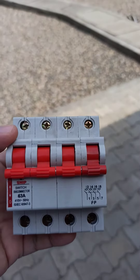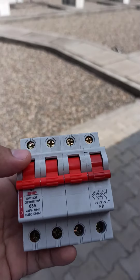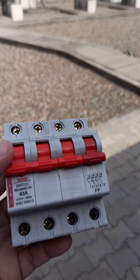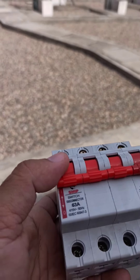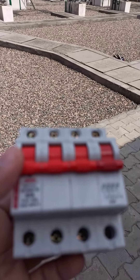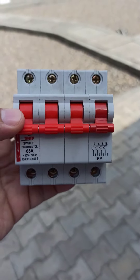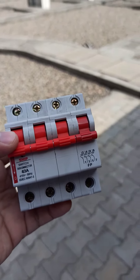Whenever we need to do maintenance, we can operate this, but before that we need to operate the circuit breaker first. This is because an isolator always operates at no load — we don't have any arc quenching medium in it. So that is about the isolator.